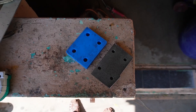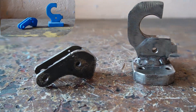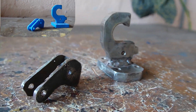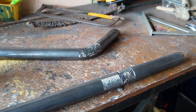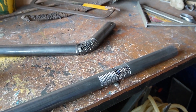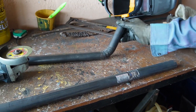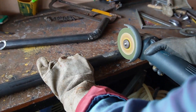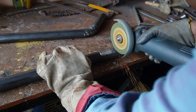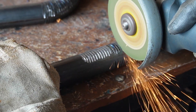Here I am finishing up the backing plate — please forgive the rough cuts on the sides. Here is everything welded up; you can see I have also fabricated the locking arm. The next thing would be the subframe that mounts onto the grab handle. I found this position to be the most robust for mounting the hook, as it is really the only part that is actually attached to the frame of the bike and not overhanging a lot.